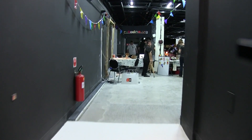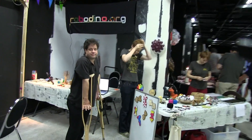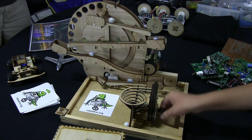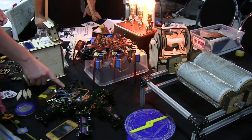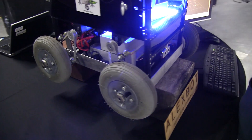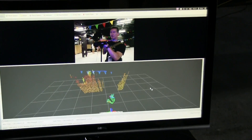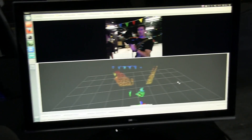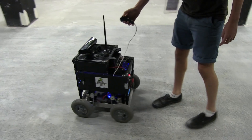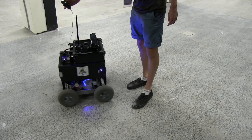There is tons of space in the Powerhouse. This is a local hackerspace. We've got robots and dinosaurs, and I'm here with Alex McClung and he's going to show us Alex Bot. It's four-wheel drive, it has four DC motors, it's got an IMU, a Kinect sensor, and GPS. That's the video feed coming from the Kinect sensor - and it's using ROS, the Robot Operating System.